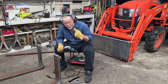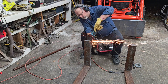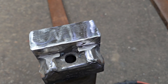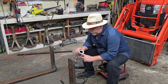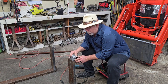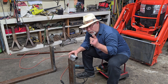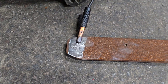Forgot my ear protection. After I cut all that weld off up here, I went back and took a disc — you want this stuff super clean. We're working on some really thick steel. I got big old fat sausage fingers — you see how thick this is. That's going to mount right there. I'm going to tack weld this on in place, but before I go to weld it, I'm going to take my torch and heat the heck out of this. I want this bad boy hot before I weld it. You also want to grind off a good clean area to put your ground from your welder.